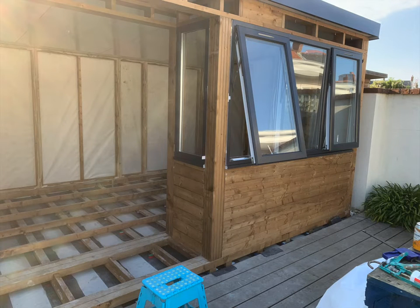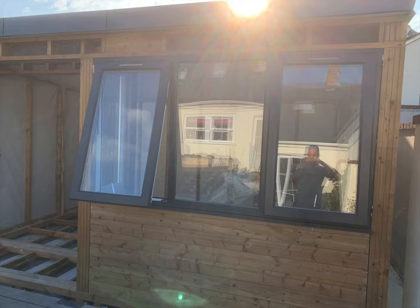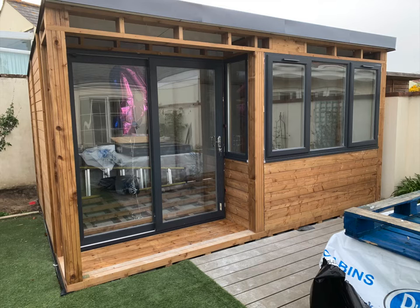With the roof in place, we set to work on the windows. I've never done anything like this before. This is just another case of patience. You get the plastic PVC frames in place to begin with, and then you install the glass, and then you use plastic packers to try and get the glass level and straight in the windows.